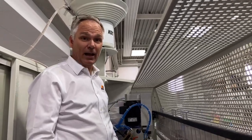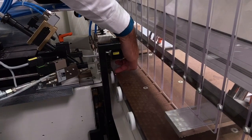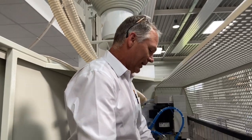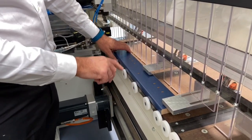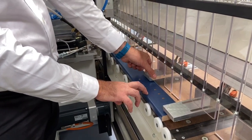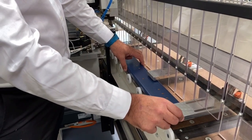The machine can use different dowel diameters which need to be specified at time of ordering. This particular machine can use a 6mm dowel as well as an 8mm dowel. The machine is equipped with a laser light to determine the length of the workpiece. I will now insert a part to show you the clamping in relation to the LED light. Where the LEDs are red and the drilling takes place from above, no clamps can be positioned. Where the LED is orange, special care needs to be taken as to where you place the clamp to ensure that you do not drill into the clamp from above. And lastly, where it is green, no drilling takes place and therefore you can place the clamp anywhere along the axis.